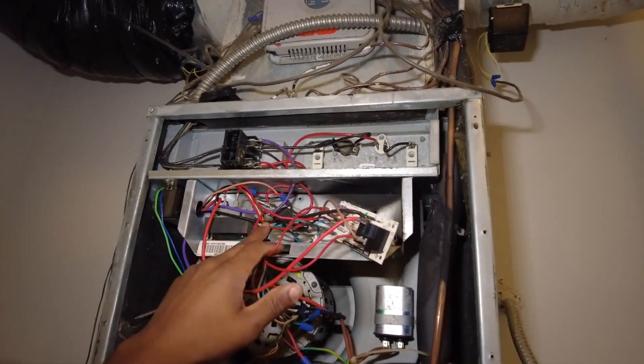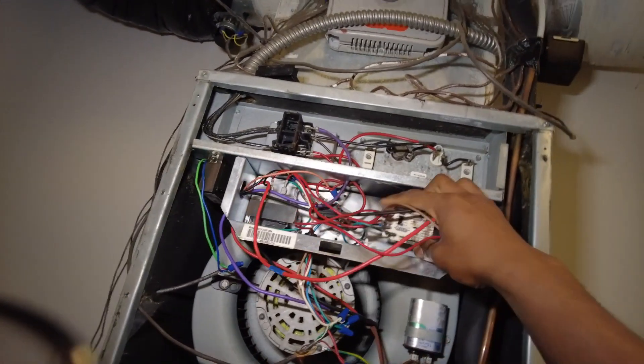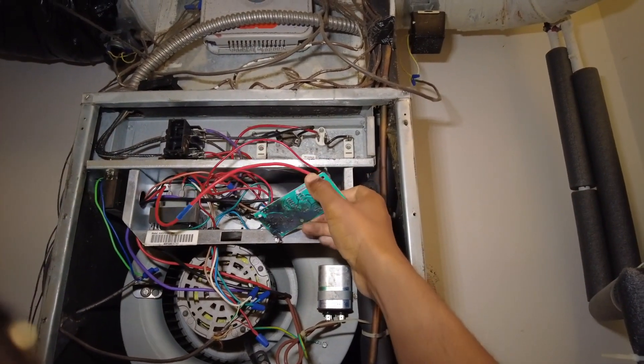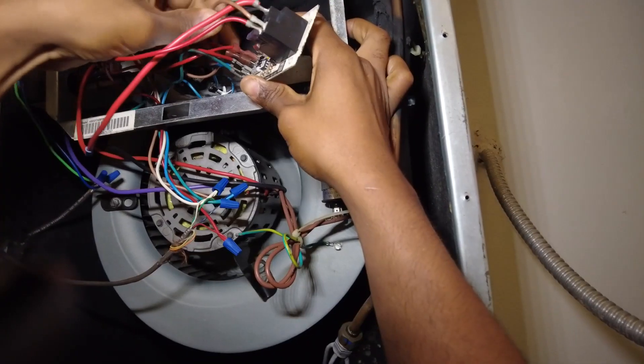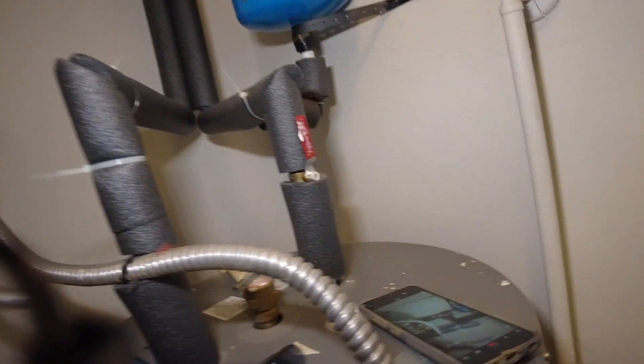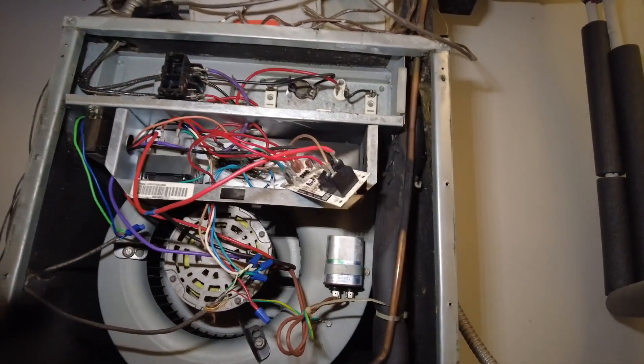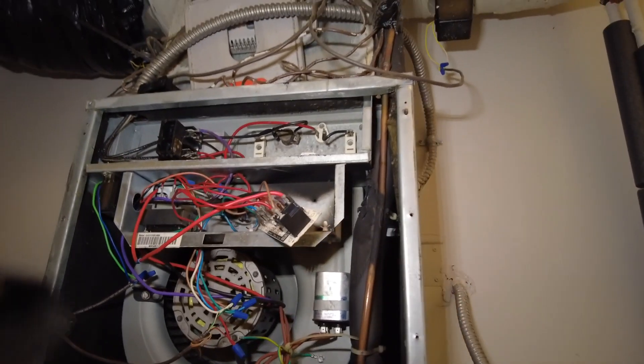So I found out the issue. You had this M1, which on the schematic is the high voltage line, going to your low voltage 24 volt side. And then you had your low voltage going to where your high voltage should be. As far as it blowing the first time, it might have been a lightning strike or something. Hopefully it doesn't blow it again. I'm definitely trying to make sure it's good this time — that's all it takes, one wire in the wrong place.